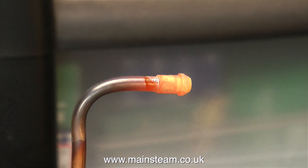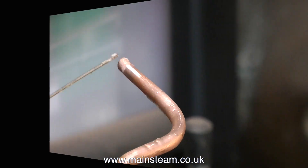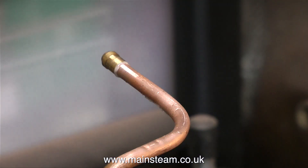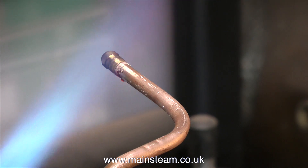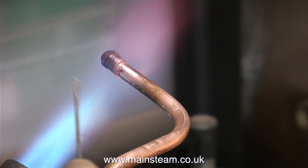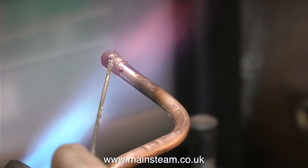For any steam boiler using a realistic steam pressure - which can be anything up to 100 pounds per square inch - soft soldering is absolutely out of the question. The temperature of the steam coming out of a boiler at 80 pounds per square inch is hot enough to melt the solder, because as the pressure rises so does the temperature of the steam. Silver solder melts at a much higher temperature, so for any soldering application other than on a very small steam toy, you need to learn how to silver solder.